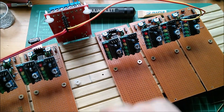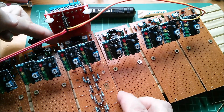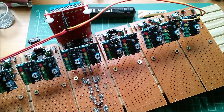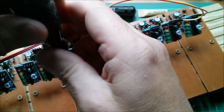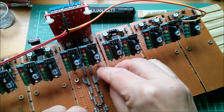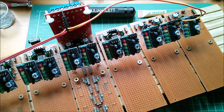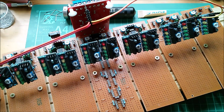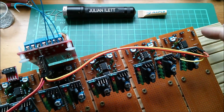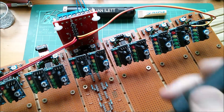Right, now the tricky bit of putting these two standoffs back on my board, mounting this back on there. I'm trying to get these screws in without everything moving around to put this board back on my piece of decking timber. That one seems to have gone in okay. That one I think is in place. So that's it — that's all 12 bar graphs. There are 14 filters actually, but I haven't fitted number 14 because it's a high pass — it's different to the band pass — and I haven't fitted number one because it's a low pass, which is also different to a band pass.